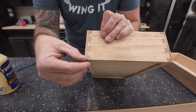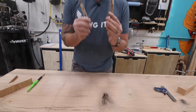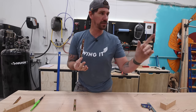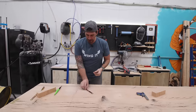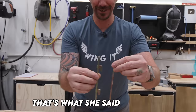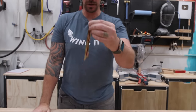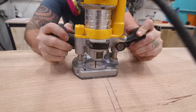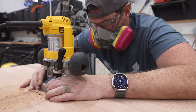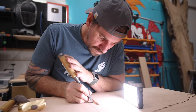This side had some blowout — see right there? That's technically the front, but that will become the back. Up next, I'm going to be putting this hardware into the headboard. So this is the hardware that I mortised into the end of the rails earlier, and now I have to put the mating piece into the headboard. The rail will come in like this, go in there, and lock into the frame of the bed. Here I'm mortising in the female side of the hardware, and I have to mortise these deeper to accept the male hardware. The male hardware on the rails has a protrusion that mates with the female side on the headboard for a snug fit.